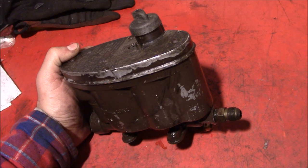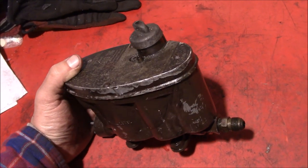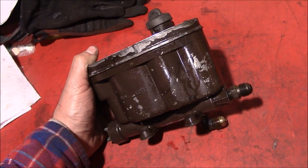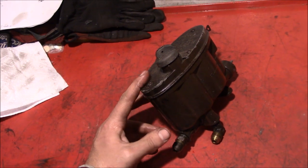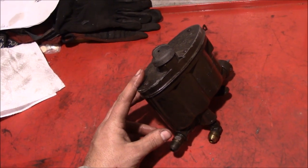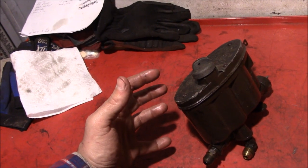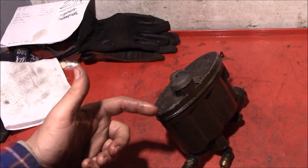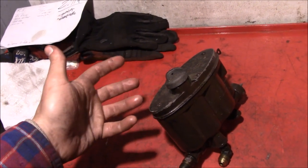You would see it on a variety of furnaces like those from Kenmore and Coleman, probably Montgomery Ward or Sears, and a bunch of others like that from back in the day. What this did is it metered the flow of fuel from an outside tank, or a tank held on the side of the furnace, and it regulated it at a constant rate into the burner — that was your thermostat or heat-regulating control.